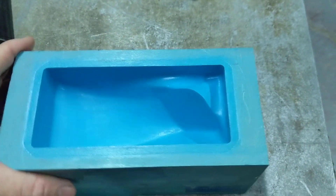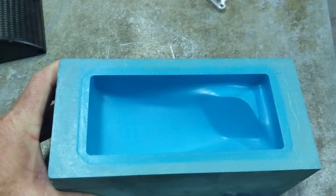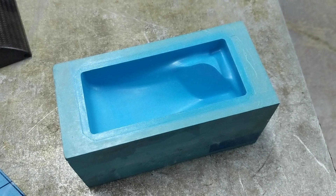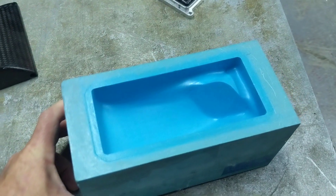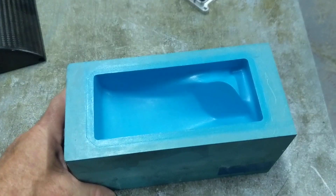These moulds — obviously I've drawn them in SolidWorks, drawn the part I want, and then take the surface off it and use the backside of the surface to machine out that. I have a large CNC router I just machine all this tooling in, and then just give it a quick hand finish. It has small lines in it from machining that you just hand finish.